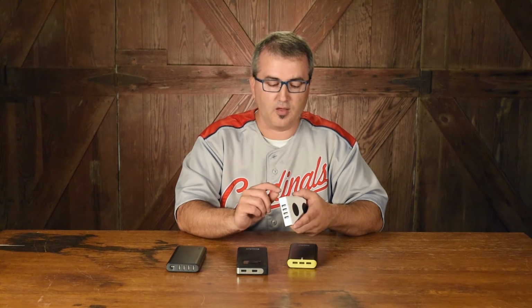Now in itself, that's not a big deal, but USB has to follow certain standards, and as a result, most of the charging cables have pretty low amp outputs. So while that would certainly charge this battery, it takes it a lot longer. Okay, so by not using a USB port to charge it and using a wall wart, they used a higher amperage port, and this battery would charge much faster.